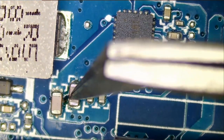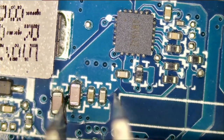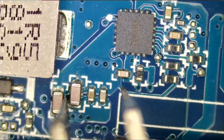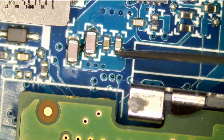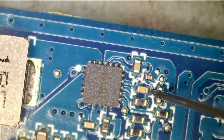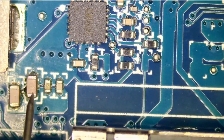It's very possible it could be any one of those two caps or maybe the chip itself. I do not know which chip this is, but the problem could be one of those big caps. I already see a burn mark here — or maybe burnt flux — where the caps got too hot and released flux from under them. We have shorts at multiple points in this area. We do not have a short here or here, so it's basically this area right here. It has to be one of those two blocks.